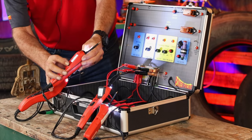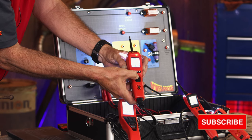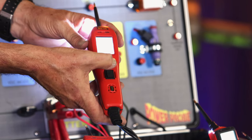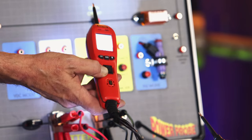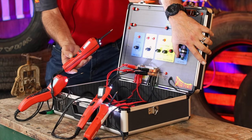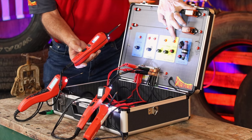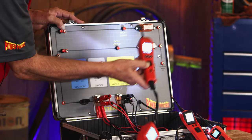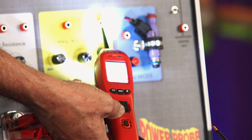Let me show you a couple of major differences. Even in the basic DC mode, you already have min/max on the bottom of the display, so there's no reason to pull up separate modes like you would on the PowerProbe 3. There are two different AC modes. Your normal AC RMS — you've heard the term RMS or true RMS — that's the way a standard meter reads; it averages the signal. For example, with a 5-volt pulse coming out: if it spends half the time at five volts and half the time at zero volts as it's pulsing, an RMS reading is going to average that — right about 2.48, two and a half volts, right in the middle of that 5-volt pulse. That's how your standard meter reads.